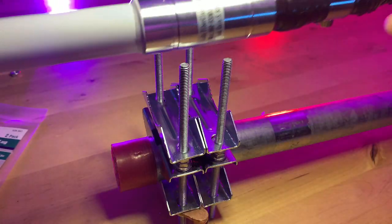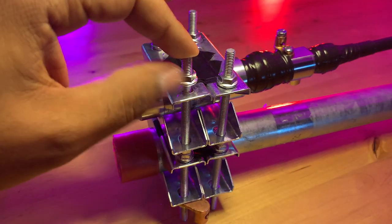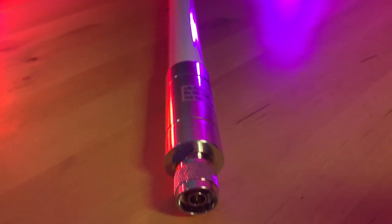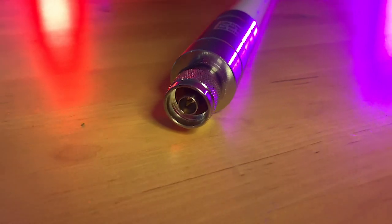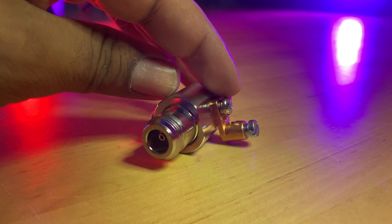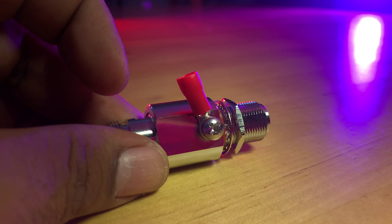I started by attaching the mast to the RAC antenna using a double mast clamp. After securing the antenna to the mast, I connect the lightning arrester. There is an N-type male connector at the end of the RAC antenna, and connected to it will be the lightning arrester with N-type female to female connections.